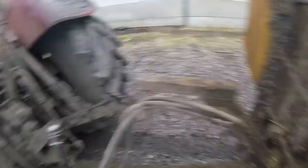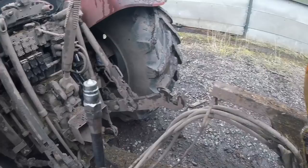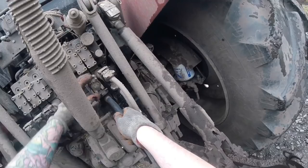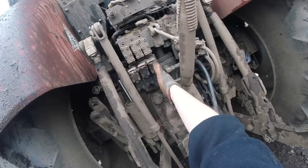Right, so we're back around at the back of the tractor. These are the pipes. I'm going to plug this one in — this is the one for my rams for tipping up, and I know it's that because it's a thicker pipe. Generally they are a thicker pipe for tipping, and you've only one pipe for your tipping — they're a single-acting ram. When they come back down, they come back down via gravity, so you only have to power them up. Just making sure that end is nice and clean. I'm going to plug it into number two — lift that little flap up, shove it in, just make sure it's locked, give it a wiggle. It's personal preference — you can put that in on any of these spool blocks — but my personal preference is to put it into number two. Those two there are for my pick-up hitch.